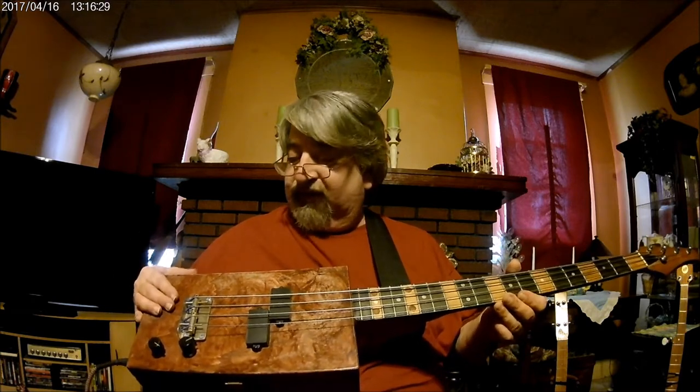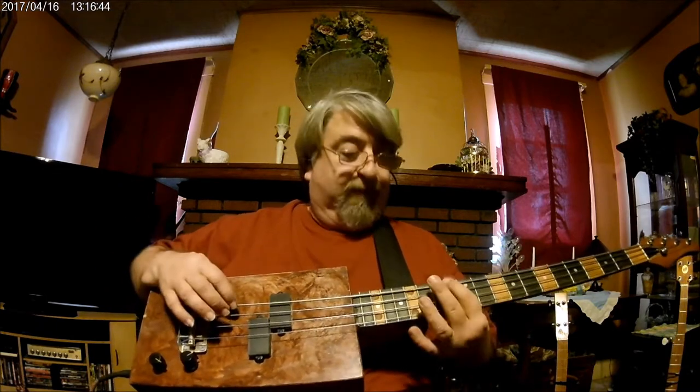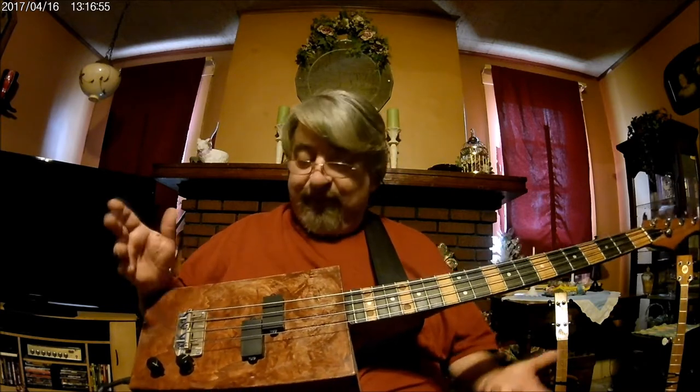Again, it was very difficult working on these. This one took me a week and a half to solve a grounding issue where the plating on the bridge was not letting signal pass through. Grounding the bridge did absolutely nothing and I still had a string buzz — not a fret buzz, but a grounding buzz. It took a long time to figure out it was the gold color coating on the bridge that was preventing the signal from going through.